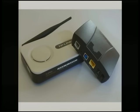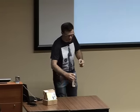There's hardware as well. So they're often MIPS-based, with Texas Instruments and Broadcom and so forth, a few common chipsets that run these. And I love OpenWRT. I've used it for a whole bunch of projects. It's very, very cool. For those that haven't used OpenWRT, it's a bit like Buildroot, which was a project to build you cross-compilers and a kernel and uClibc, BusyBox and a root file system for a device. It's also got something which looks a bit like the ports tree in BSD. So a whole load of makefiles for all sorts of software. It will go off and download and patch and make you packages for these things.